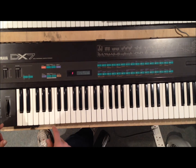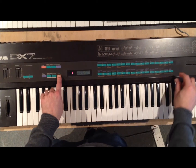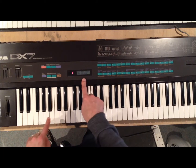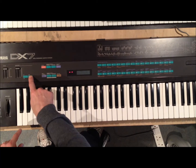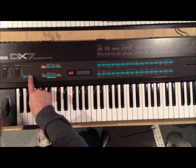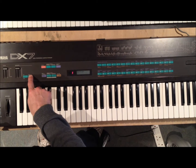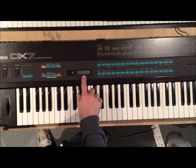The way to get into a DX7 self-test mode is to press function, 16, and 32 in that order to get into the test mode entry. There are a couple of test levels — the LED and LCD tests — and we're not interested until we get to test 9. And here we see: error, RAM IC20.